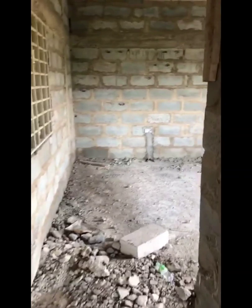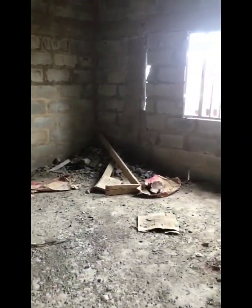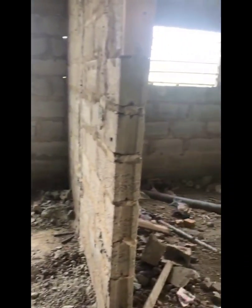Before plastering, we also had to do the AC cabling. So there's electric wiring, TV cabling, and AC cabling that all had to happen before plastering — we made sure that was all done during phase one. Wiring hanging out from the ceilings and anything meant to go in the wall had to be chiseled in, because in this case it's brick rather than drywall.